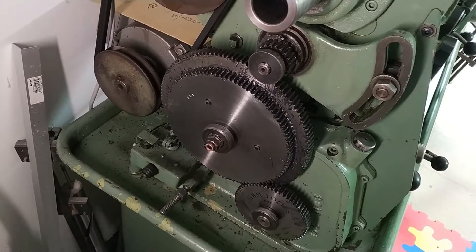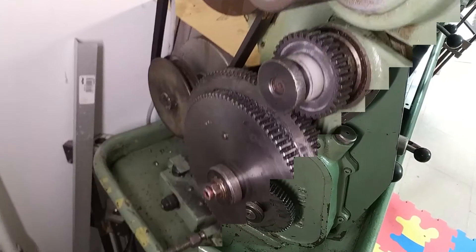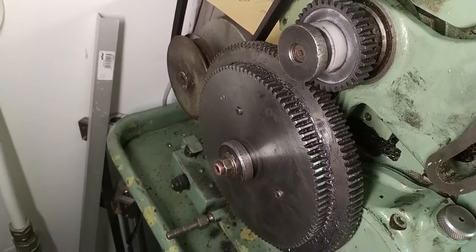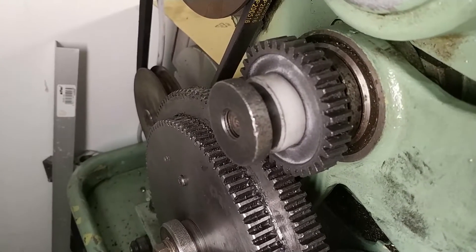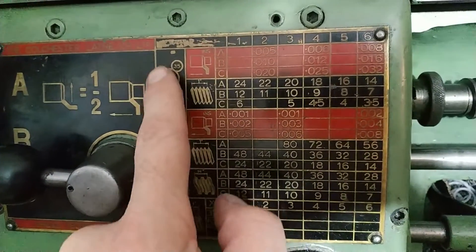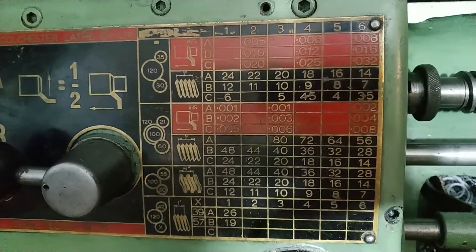These are the gears that are now installed on my lathe. This is the new configuration — you can see the first gear from the top. It's the gear made by me on my lathe. This is the screw chart for 8 TPI, and with this type of gears it is B and 5 for the 8 TPI.